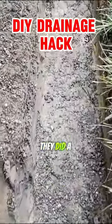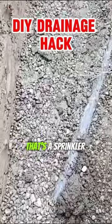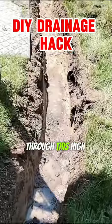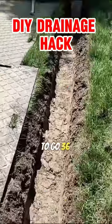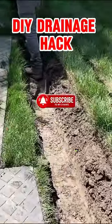Now take a look at what the guys did — they did a really clean job here. The bottom is super smooth. That's a sprinkler line, and you know that we're digging shallow if we're not under a sprinkler line. We were able to cut through this high point to get this water to drain to the very back of the yard. We didn't have to go 36 inches deep, because we didn't do the side of the house 18 inches deep.